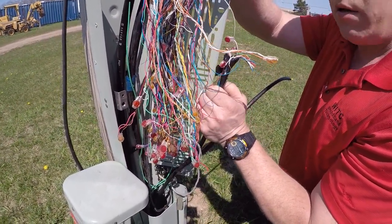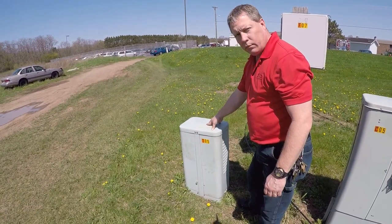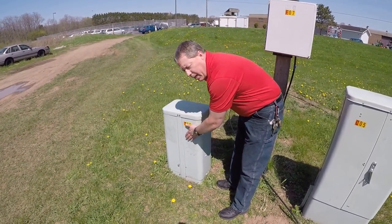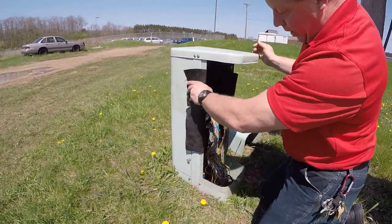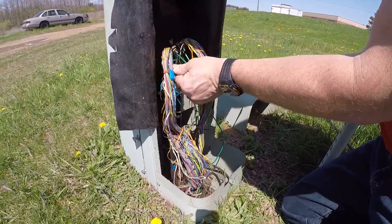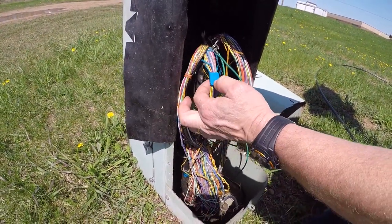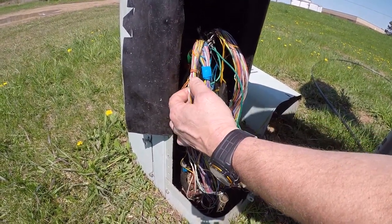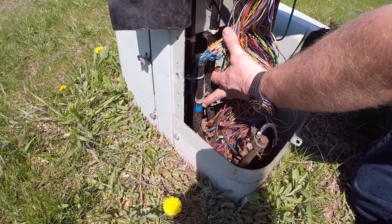This concludes the pedestal informational video. This is a bigger underground pad system that has a variety of different types of cables and I'll show you what's in here and what it looks like. In this cable we still have two 50-pair cables on one side, and here's the grounding alligator clip that I was talking about before. This pad is identified once again with the two binders since it's 50 pairs — so this would have pairs 1 through 25, and this would be 26 through 50 — and they're also designated with the blue, which tells me this is coming from the central office.